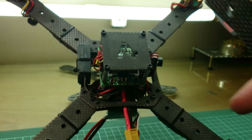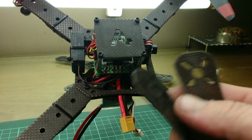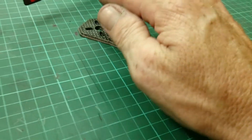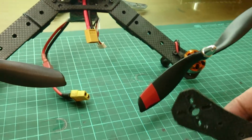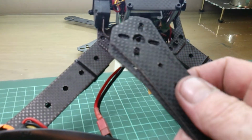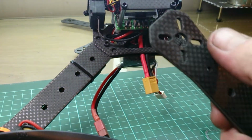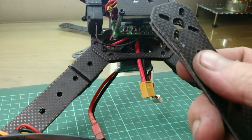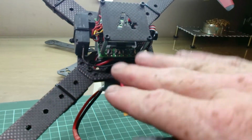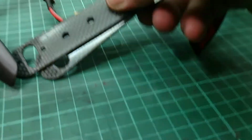My initial idea was to use 2 millimeter arms and then stack them up to give people the options of going from 2, 4, 6, 8 millimeters, different strength of arms. But what happened with this is that no matter how well the arms were sandwiched together with a couple bolts and mounting the motors on there, they did not act as one piece of carbon fiber, so it made them quite soft, with a lot of torsion and also a lot of bend to them.